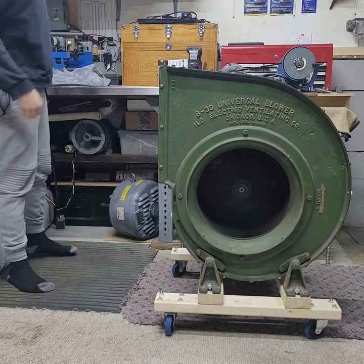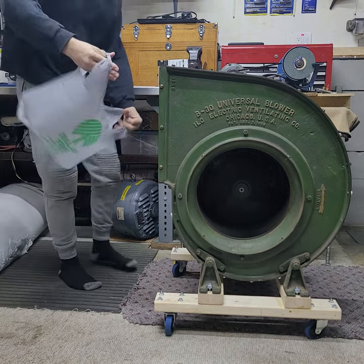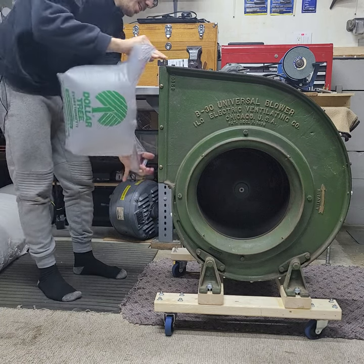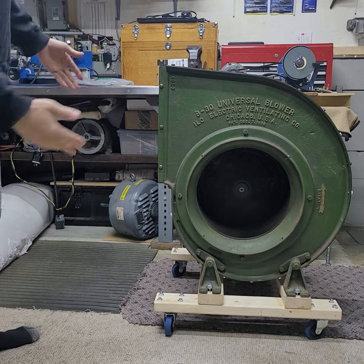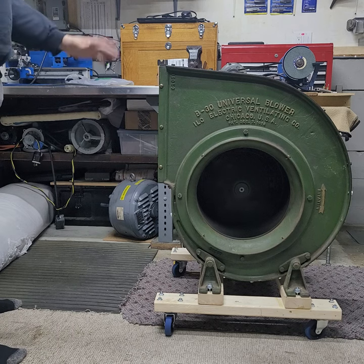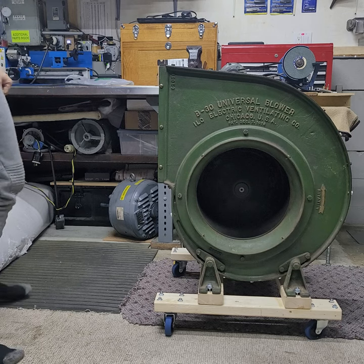holy cow, you can hear a difference. And there's definitely some air moving here. It has no problem moving air at all. But now, as I said before, these aren't designed to run wide open like this. Without any back pressure, it is drawing more current. The motor's rated 5.5 amps, so we're still well within spec. Right now, running at about 3.4, 3.5 amps.